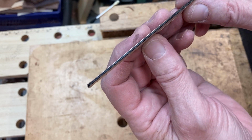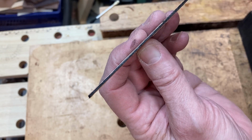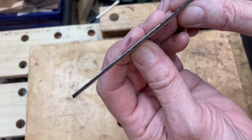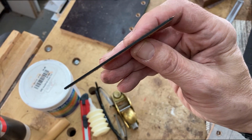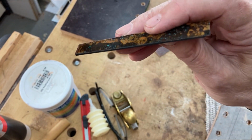I'm going to try now, I'm going to sand this off, perhaps recoat with the grain filler. Then I'm going to try acrylic paint, maybe that will stick to the grain filler. So here's hoping. Finally, here's the edge of my test piece. This is with the acrylic paint, and that seems to have worked perfectly well.